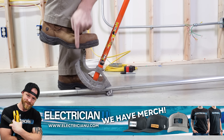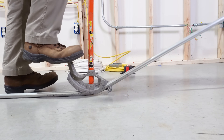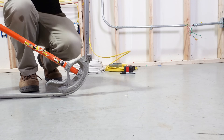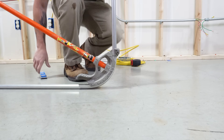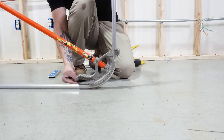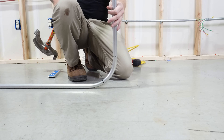I'm going to be pushing with my foot straight down and pulling back on the pipe at the same time. You don't have to go crazy and hard, especially since this is aluminum — you don't want to kink the conduit. So you just want to roll it very neatly. Look how easy that bends. I don't do it all in one crazy motion; I work it up as I go. Check with my level — we're off a little bit, so I need to come up just a bit. Little adjustments like that go a long way, and boom, that's level. You can see the bottom of the shoe is about an inch off the top of the conduit, and that gets me level. The more you bend, the more you understand that every bender is going to be a little bit different, so you know how far to apply pressure.